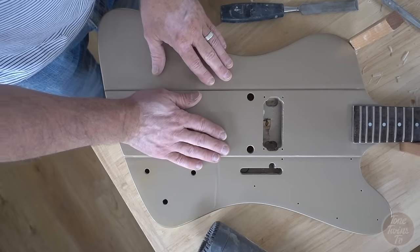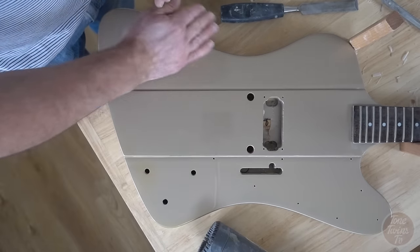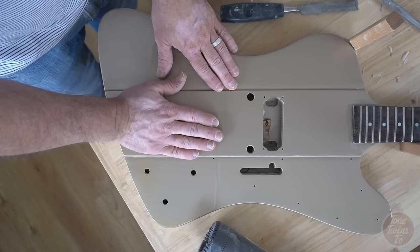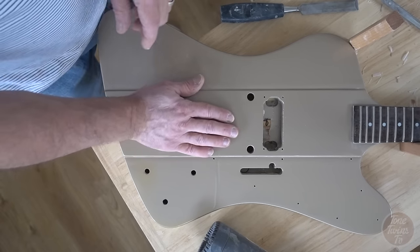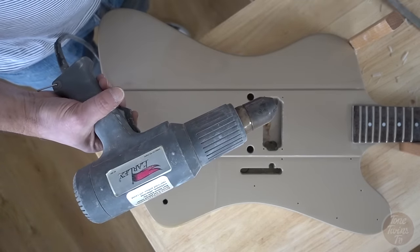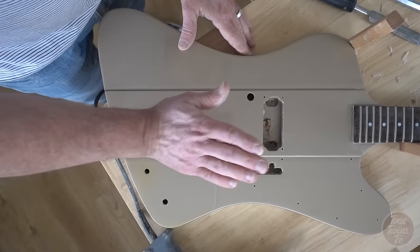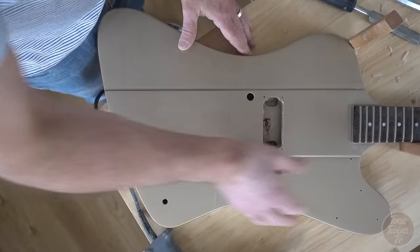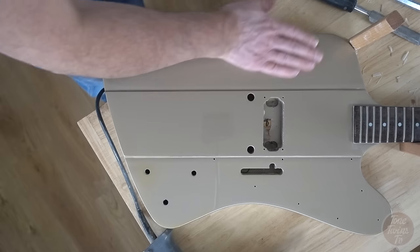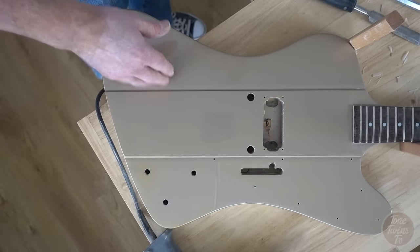Don't rush it because you'll just make a mess of your guitar. Accept the fact that you're probably going to create a few chips and gouges in the wood. So if the intention was to turn this into a sunburst finish, I wouldn't have even taken this project on. And if you look online for videos about stripping Epiphone guitars, you're unlikely to find one that really gives you the information you need. So here's my heat gun and my chisels. Guitar's on the workbench — obviously I haven't put any padding underneath it because I'm not concerned about damaging the finish. I've got a couple of bench dogs just holding it firm. This is going to take an awful long time, so I'll just take you through the basic technique that works best for me, and then I'll put it on fast forward.